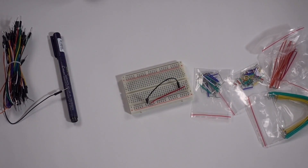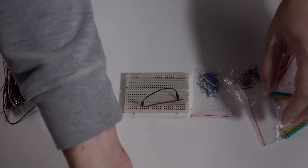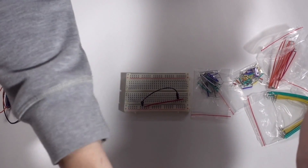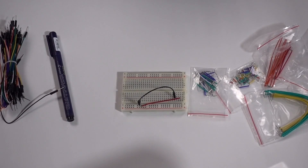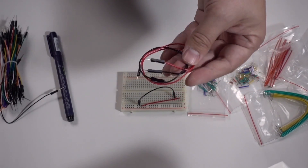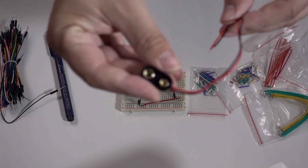I take my ground like so. Now we haven't got any power going into that power rail, which is why we have to use either a battery or some form of external power, or we plug an Arduino in. I can see there are black and red wires in the official kit — just these couple. So what you might do is plug in a battery.